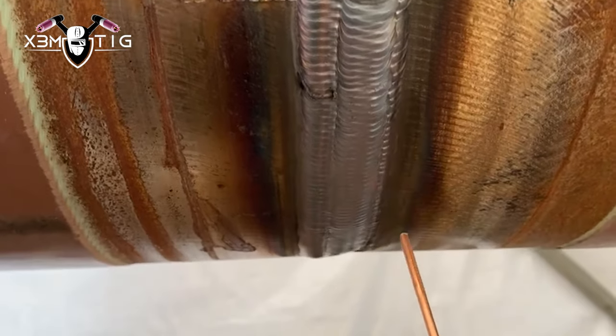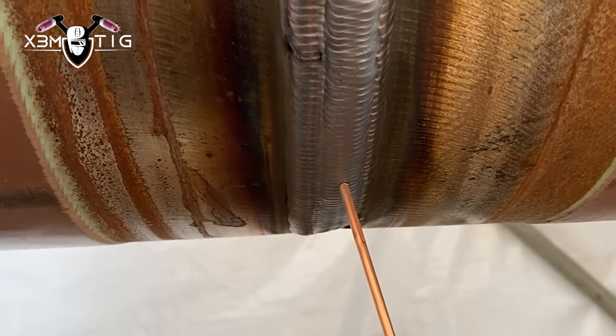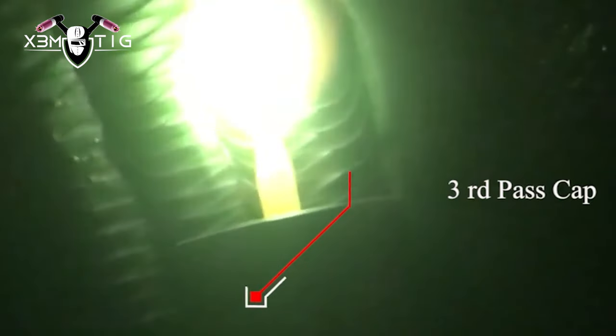At 160 amps on a cap, higher amps give you more control — you can go faster. With a big cup you can have wide steps, go wide with each step, which helps you move from uncomfortable, awkward positions especially at the bottom, and helps you move faster going all the way to the top.